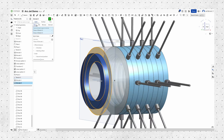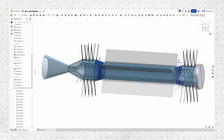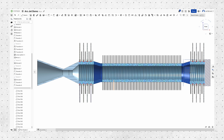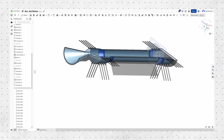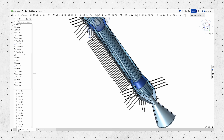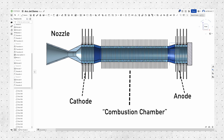Let's hop into Onshape and take a look at the cross-section. The whole assembly is built using smaller cylindrical disks, each of which has cooling channels for water, and some of which have channels to inject argon or air as well. These disks are made of copper because it's such a good thermal conductor. It's okay that copper melts at a lower temperature, because NASA flows lots of water through these disks to wick heat away from the chamber. Technically this thing is kind of a regeneratively cooled rocket engine — it has a combustion chamber where the arc forms and air is injected, then a converging section, throat, and diverging section to accelerate the gas to hypersonic speeds.